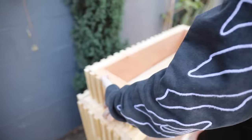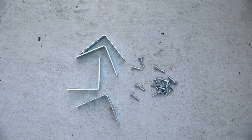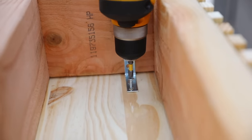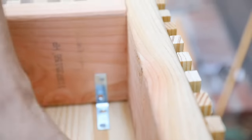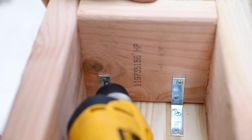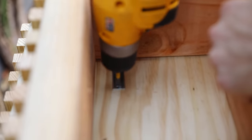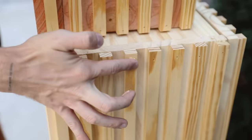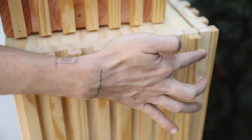I didn't add detail sections to the back side since no one will see that. To attach the pieces together I'm using little L-brackets picked up at the hardware store — two screws on each side — attaching the base legs to the cabinet itself. I added four of these all around the entire interior of the box; creating the box made it easy to attach them cleanly. Once that's on, it's nice and sturdy. For a clean finish before staining, I grabbed some stainable wood filler to fill all the little brad nail holes, then used fine sandpaper to remove any excess filler residue once dried.